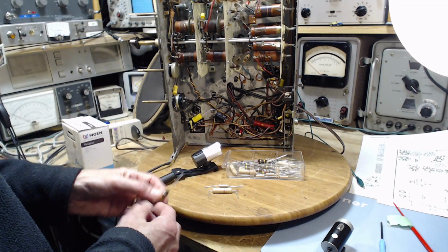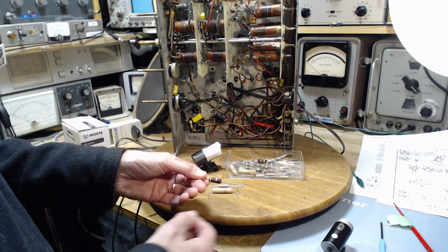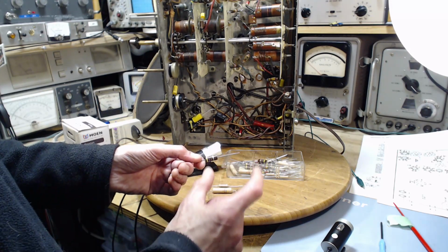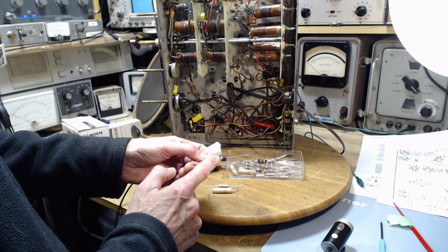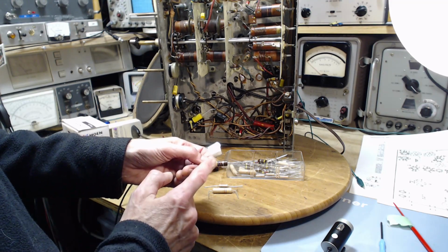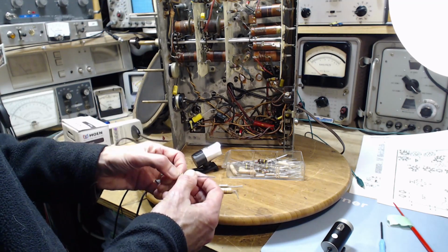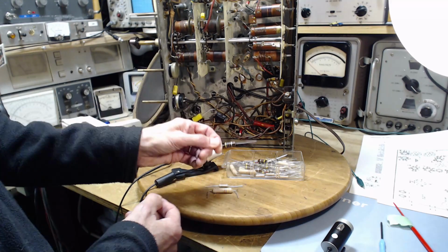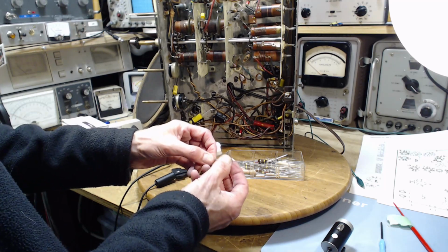So just in noticing, as pointed out to me and was certainly in my head, it's a silver band resistor. There's a range of true values which can carry this label, right? And the silver indicates there's a 10% range around the value on here, and 520 is just getting right out on the fringe of that range. The interesting thing to me is that all these tested the same. That's the part that gets me a little bit crazy.